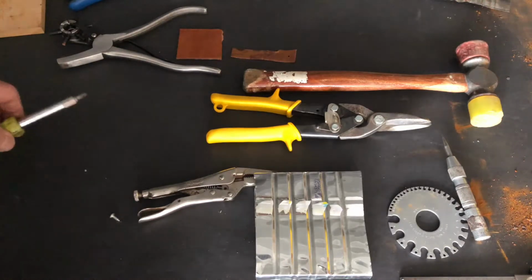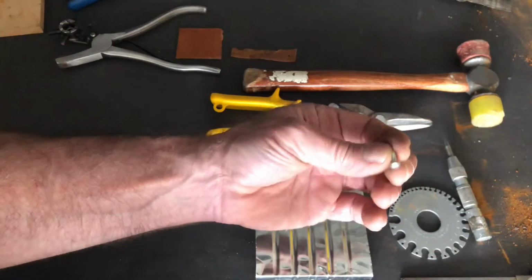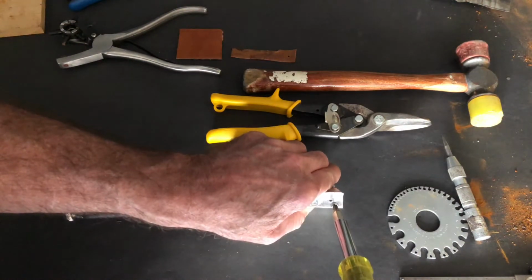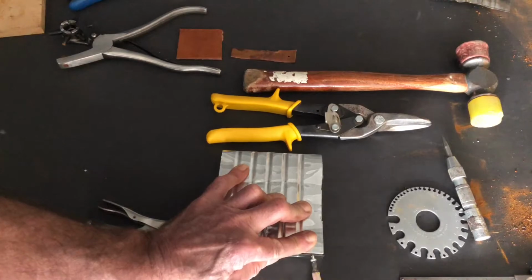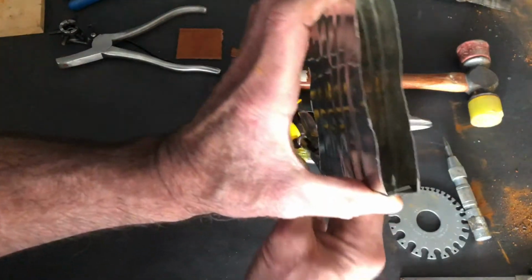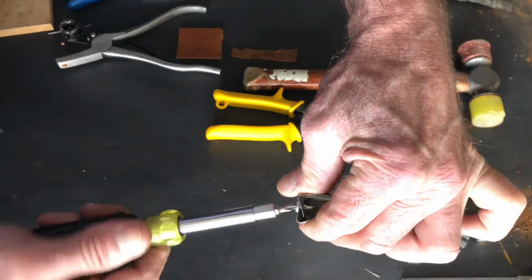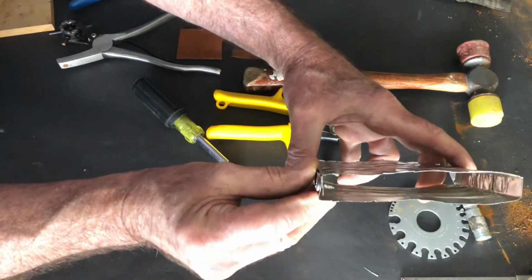Okay, let's give this another shot. I've got my screwdriver with a number 1 tip. I have a number 6 by 5/8 of an inch sheet metal screw. I've got the work held in place with locking pliers. And let's see how we do. I've got hands so shaky that I could thread a sewing machine while it's running. And there we go. Let's see if we can draw that up a little bit tighter to close that little gap between the two sheets. And there we have it. We got that to pull up pretty tight.